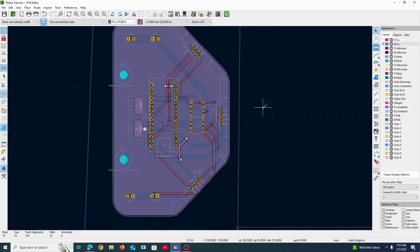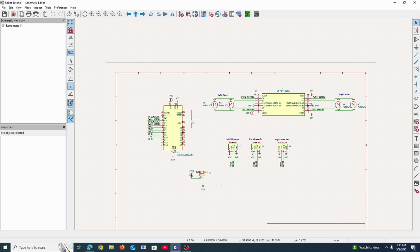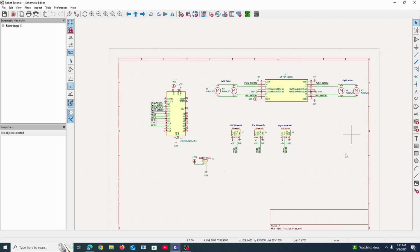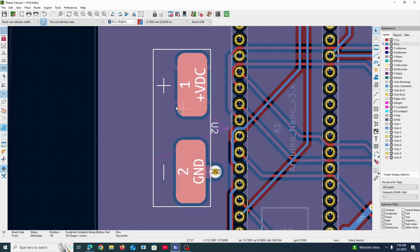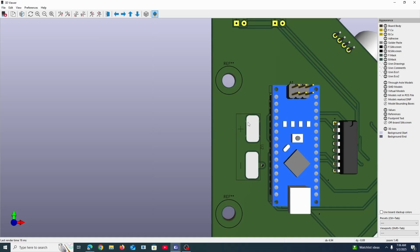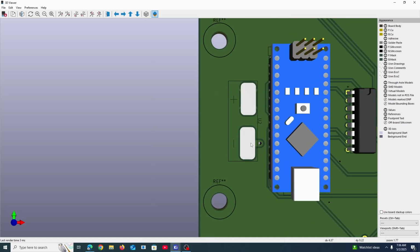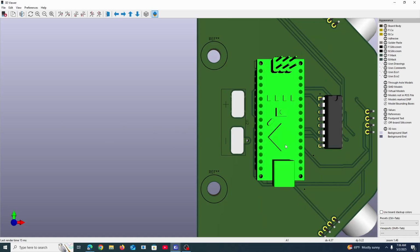And so you can kind of see how the basic example from before with just one ultrasonic and one LED can apply to something like this. And then this is a little new. So this sort of represents this right here. And so we would be able to take two wires, a positive wire from the battery pack, for example, and then a negative wire, and then we melt metal onto these, essentially bonding them together so that positive can go into here and power everything else, and the negative wire can be bonded to that and have everything return to the battery in a closed loop.